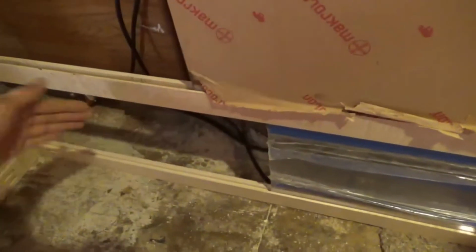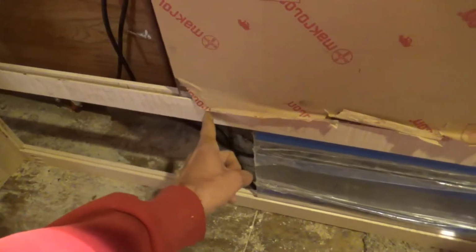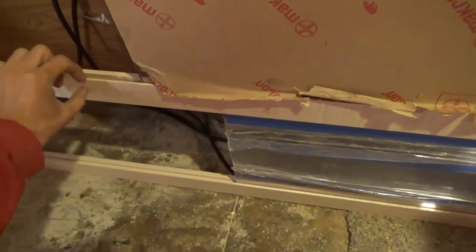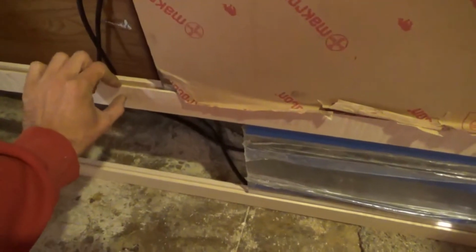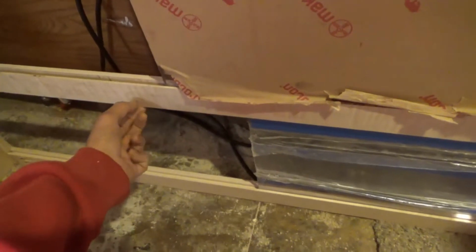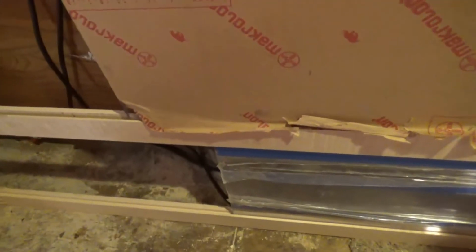And then as I'm doing that, I'll start up top and work my way down, and then I'm gonna figure out how I want to hold the floor panel on. Since I'm not gonna dado out a groove on this, I'm gonna actually use the rail that holds the upper door. That's gonna be up here, and then I'll leave a little bit of a gap for the lower rail. Then that way the plywood will fit right in there.